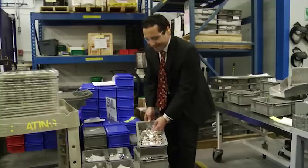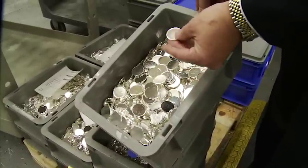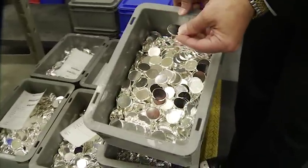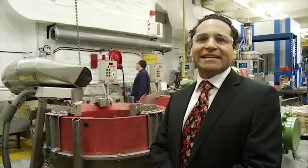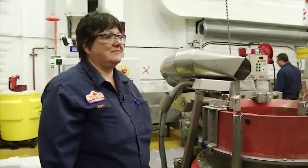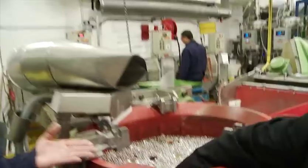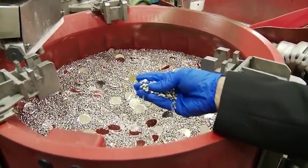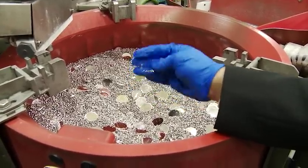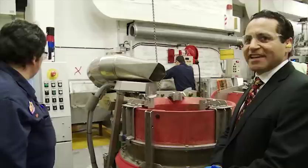There's a whole bin of blanks that have just come out from the blanking machine. They look good, but they're still not ready to be made into coins — they go through another process to make sure the surface is just right. I'm with Anne at the polishing station. The machine uses small and medium bearings — little round balls together with the blanks — acting like satellites, polishing the blanks just before they proceed further. Anne turns it on so we can watch the process in action.